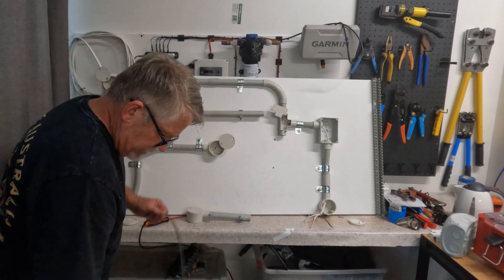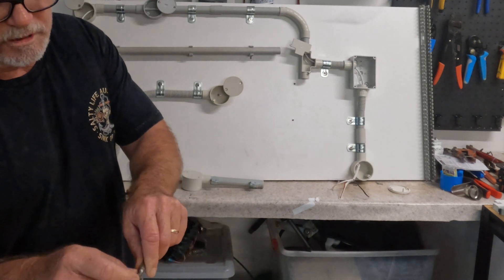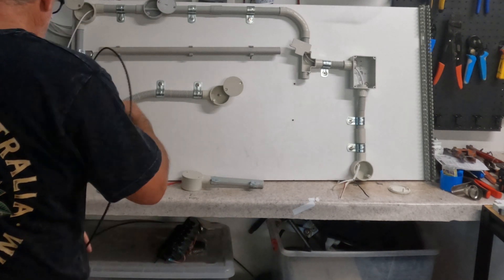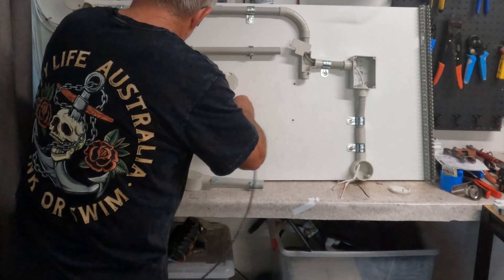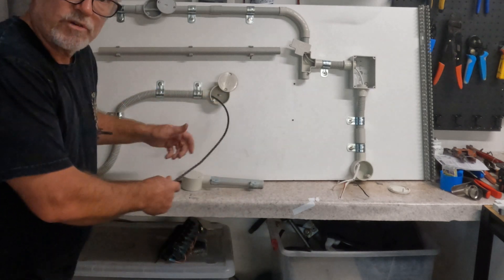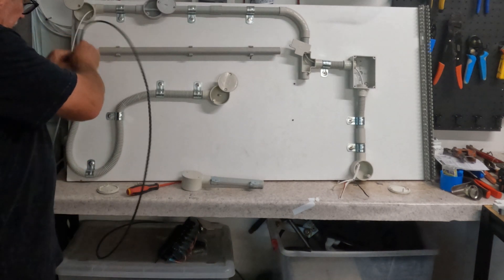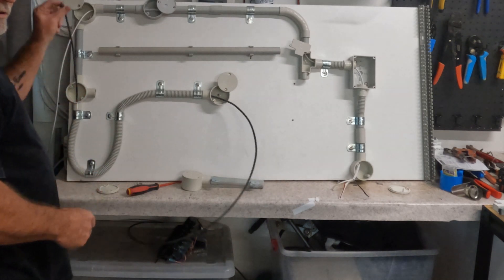So I've cut my cable off that end and I'll try to get a wire on there and see if we have any luck getting through. Coming from this other side — there we go, it's through. Through the corrugated conduit with a couple of bends, came through from that side, nice and easy. If I try coming from the other side it's not quite as easy because the snake gets caught up on the corrugations. Quite easier coming from the first side — straight through, no problems at all.